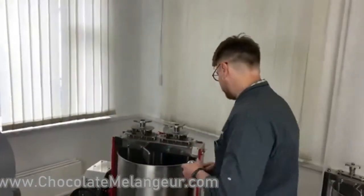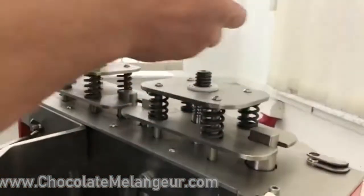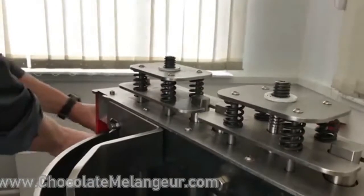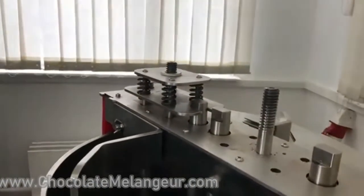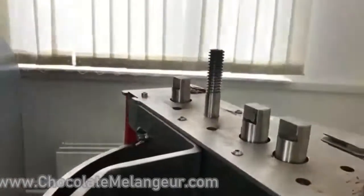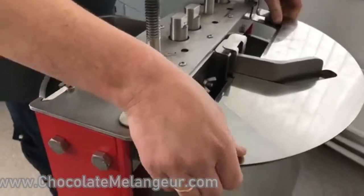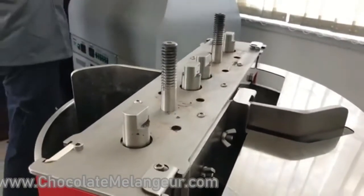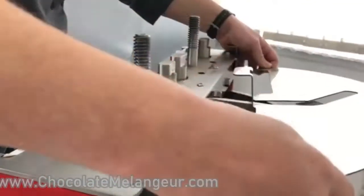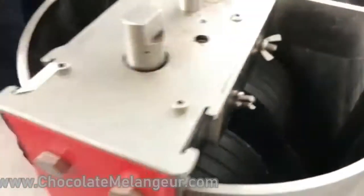Okay, let's start. First you need to release these parts, remove these parts. One more important thing, after this the chocolate heated to 87 degrees, and the sugar and milk caramelized, so this could be the reason for the bad noise from our melanger.